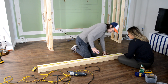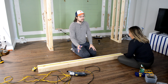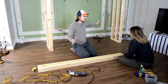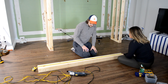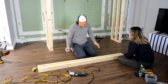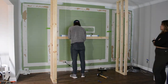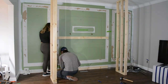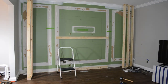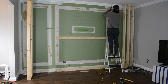These boards are going to go horizontally on the wall and we're going to mount everything to them. We're marking the center of each board and aligning it with the center of the wall so everything is centered. These are 68.5 inches, so half is 34.25 inches. These three horizontal 2x4s are used to attach the main media center to the wall since they didn't happen to line up with studs. The three boards are screwed into the studs vertically and then the two sidewalls attach to those.